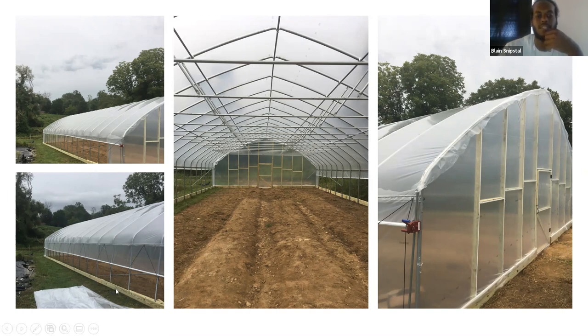If these are all installed properly, you can rest that roll-up bar on them when you're attaching the plastic to the roll-up bar. The plastic is attached to the roll-up bar with little clamps that just clip right on. And that will give you a nice and straight roll-up bar. And you can just use your eye hooks for that. Those are installed every other bay, starting from the front. And then you have rope hooks or rope clips that are installed every other bay as well, alternating between the eye screws, and that gives you that zigzag fashion. And that's essentially it.